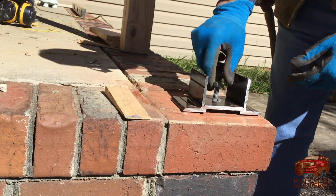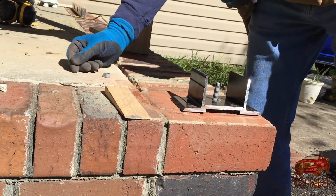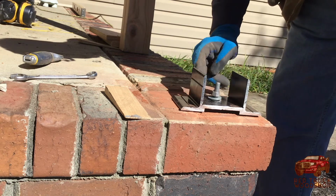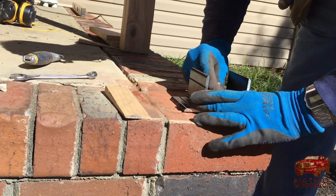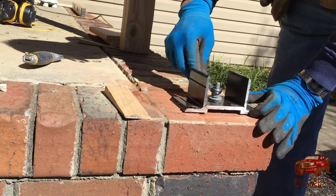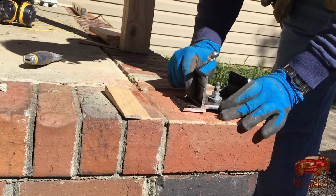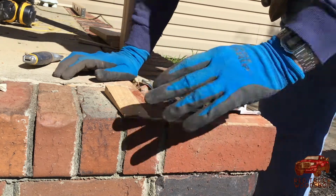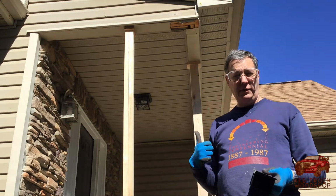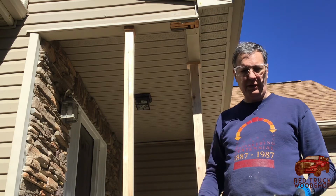Our epoxy has set up. So I'm going to go ahead and secure this to the foundation. Right now I'm just doing this loosely. I'll tighten it up later, be sure I got everything in proper alignment. So now I got a measurement of 89¼ inches. I'm gonna go cut my post, and we'll bring that out here and set her up.